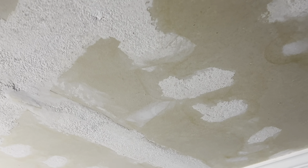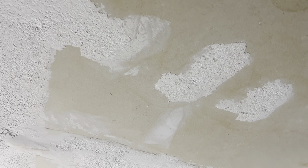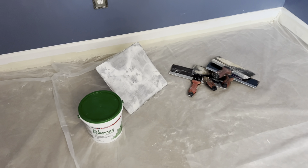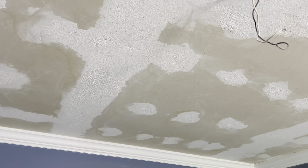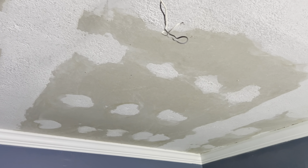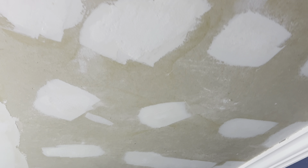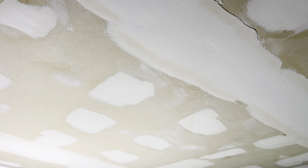I'm done with the sanding, however this did not go as I was hoping it would. As you guys can see it's obviously not smooth or ready for paint. So what I'm going to have to do is take my finishing mud, put it all over this textured part of the ceiling, give it a day to settle, and then give it one more sanding and then we should be smooth and ready for paint. I did a skim coat on those textured areas of the ceiling that I couldn't scrape off and now it's ready for some sanding. Everywhere that I needed to put mud is covered and the next step is to sand it and get it smooth and ready for paint.